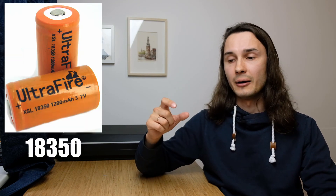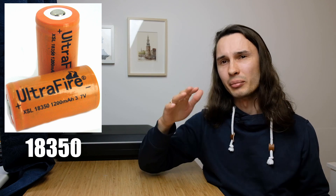I'm thinking of combining three 18650 battery cells, which will give about 12 volts — a little under, equivalent to a 3S LiPo battery for those familiar with drones. I could even combine six cells: three in series and two units in parallel for more capacity. But for that I'd need to redesign the handle, since neither three cells vertically nor two horizontally fit — it would have to become bigger and bulkier.